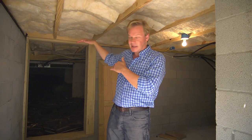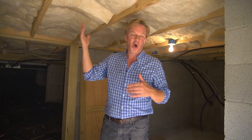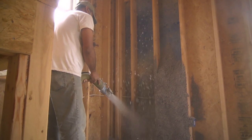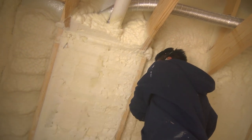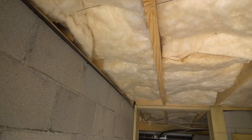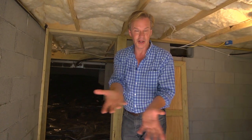This is a little different down here because we're talking about the underside of the house itself. We've already put the insulation in the walls. We used the cellulose and built out the walls — they're 6 inches thick. And then on all the slopes upstairs, the roof, etc., we used the soybean foam insulation. But in here, we're using two other products that will help finish off the entire envelope around the house from top, down along the sides, now underneath.